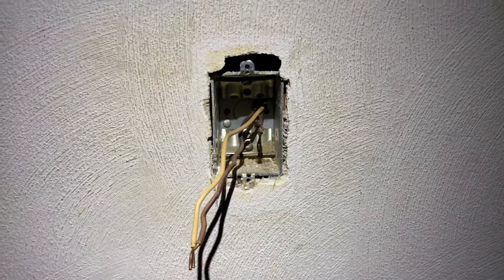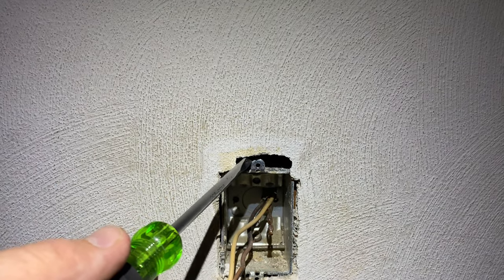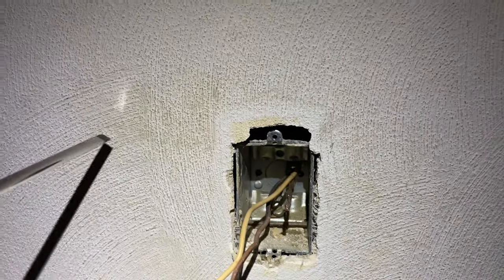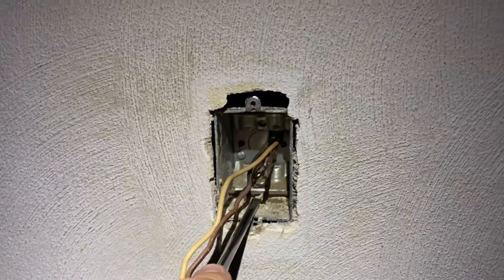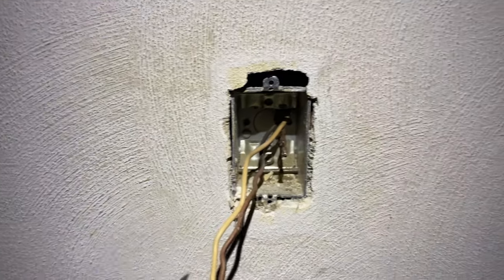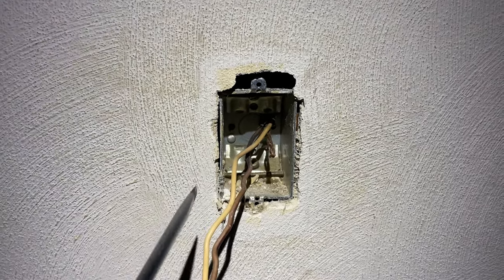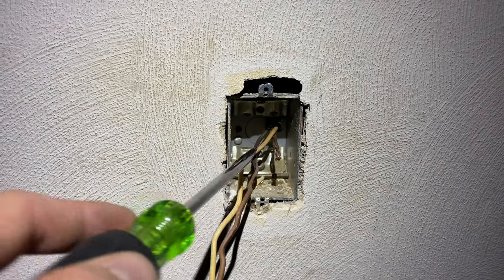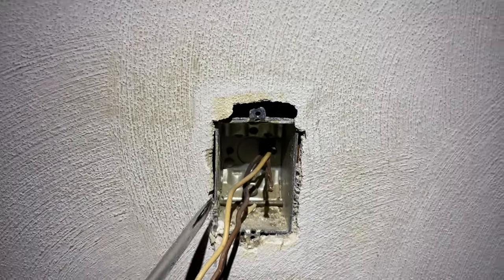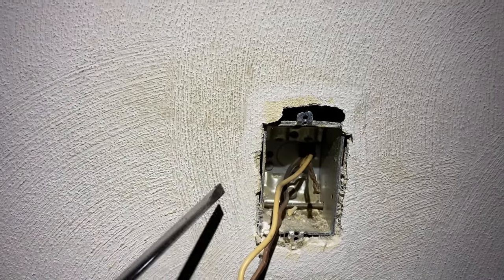So here's what I'm doing. I have an outlet — this chunk of drywall, actually just mud, fell right out, which was awesome. I'm going to remove this box and put a two-gang box in because while I'm doing the fan control kit, I want a separate one for the lights so I can control them independently. This right now does not have a neutral wire — just a live, load, and ground — so I need to get neutral wires to my outlet, and then a live and load for the light.